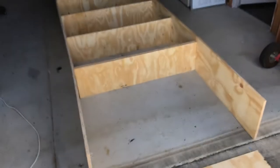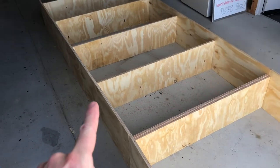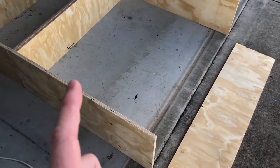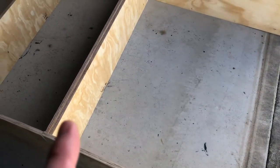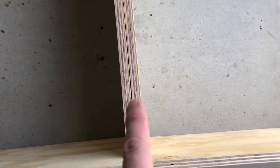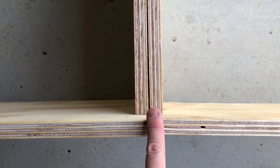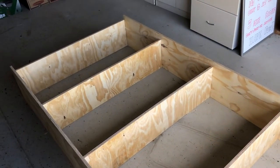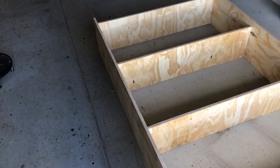The main length of the putting green is 3400mm long but my side piece has only come in at 2400, so I need to add another metre on the end. I've cut another couple of metre panels and an extra support in the middle. I'll join these two together with some nails and glue — that'll give me an edge to nail the side in and the whole length will be 3400mm long. Then we're going to work on the extension piece.